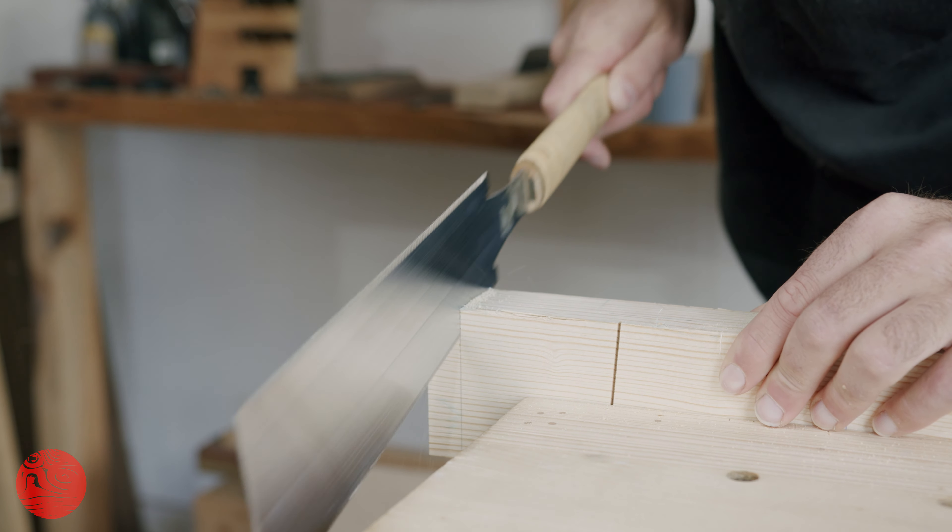How do you distinguish between the three sizes? I will be the first to admit that I completely underestimated the 270mm Ryoba early on in my time at JTA. The 270mm Ryoba has very, very big teeth. Japanese saws determine their tooth sizing with the size of their plate, so if you are looking to do bigger cuts and need bigger teeth, you go for a bigger saw plate. The 270mm I found was a little bit too heavy for my furniture and box scale work. However, at the start of this year we ran our teahouse class with Greg and Yor from Fujimoto Traditional Carpentry Company and the 270mm did all of that work. Every student was given one of these, every student did their tenons with one of these, and it gave excellent results to students from a huge variety of experience levels and professional backgrounds.